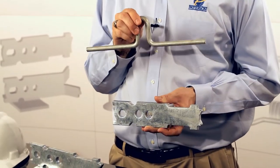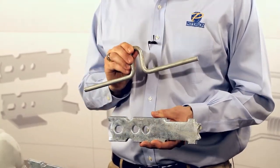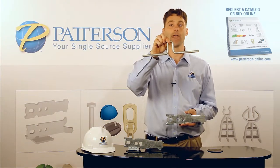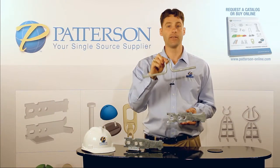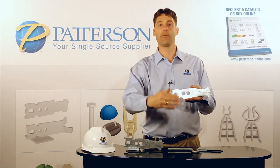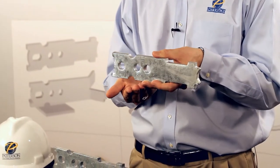Another safety aspect of this product: it's not uncommon for pre-casters to try and make their own shear bar. We do not recommend this. The shear bars are very difficult to bend — as you can see, this is a very narrow radius of the shear bar. This is not something that a typical pre-caster can do in their plant to get this type of bend. Quite often what you will see is some type of bar that just kind of rounds the top, which can create a premature shear cone failure at the top of the anchor, not at the bottom where you really need the capacity.